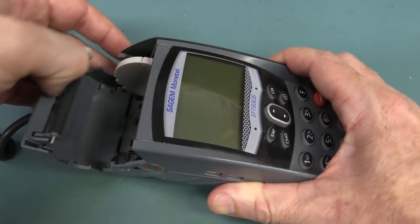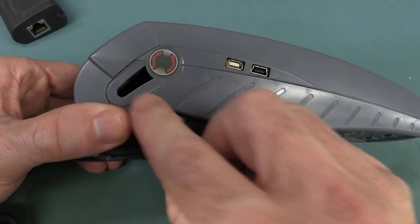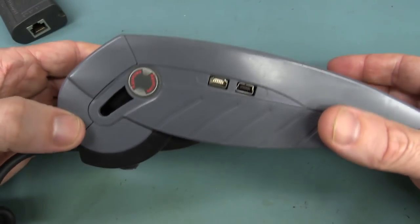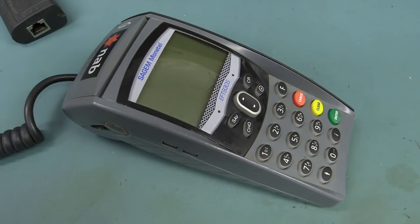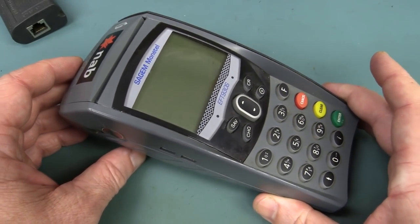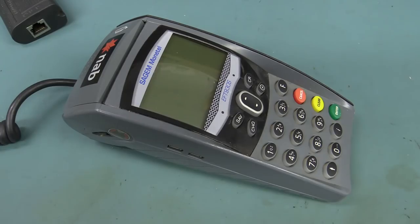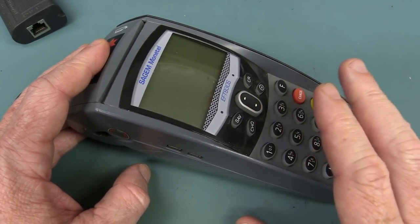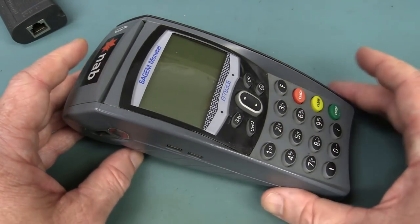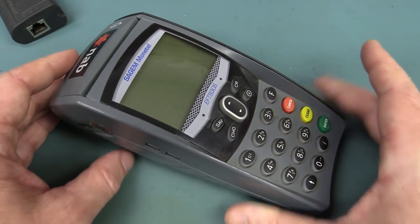It's got a printer as well — just a cheap thermal printer — and a security locking tab. We really want to find out what the anti-tamper mechanisms are in this thing; that's going to be the fascinating bit. I don't particularly care what processor it uses, although these often use a secure hardened processor with self-destruct mechanisms. The datasheet says it uses a 32-bit RISC ARM9 micro at 200 MIPS, but also says it has a co-processor, which I expect to be a security-hardened processor.